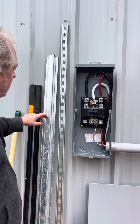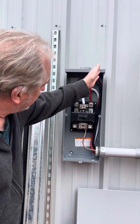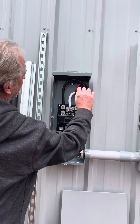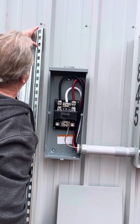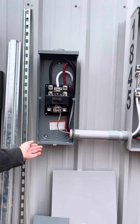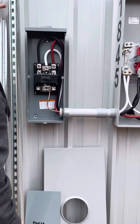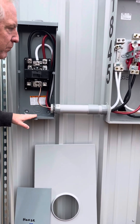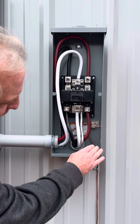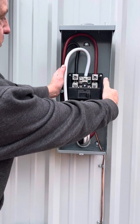These panels are mounted with a piece of girt and a piece of channel. There's a girt that runs behind here straight up and down — two pieces — and then pieces of channel: one across the top from girt to girt and a piece on the bottom. They're mounted with a nut that runs through the channel to the mounting bolt. I ran these pieces straight up and down on the boxes at the bottom because the wiring goes straight through, and running the channel the other way would be in the way of those wires.